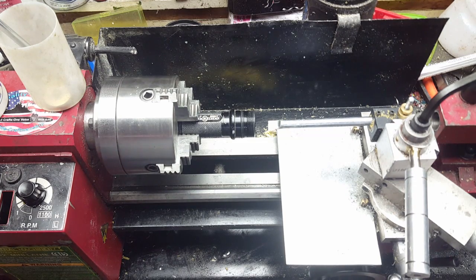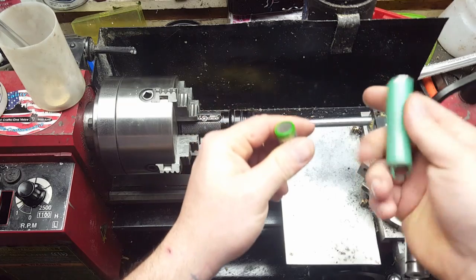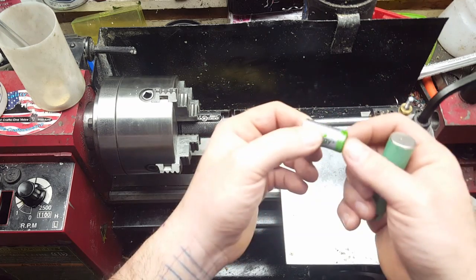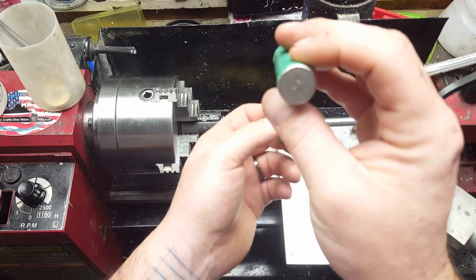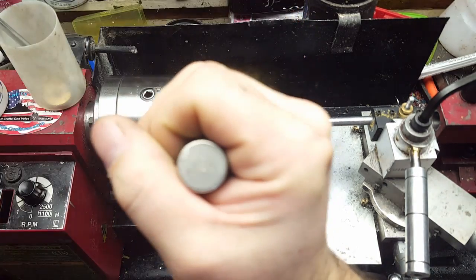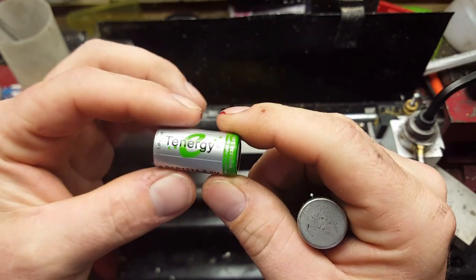Now we can try some kerosene — oh, what am I doing? I'm not even telling you the purpose of the video yet. Well, we've got two batteries here. They're almost identical in diameter. However, this is an 18650 and this is a 16340. CR123 is another name for this one. This is what you find on electronic cigarettes, high-end flashlights, laptop battery packs, Milwaukee battery packs, et cetera. Those are tabs from where it was welded originally in the battery pack. These are LiFePO4. These are lithium-ion.